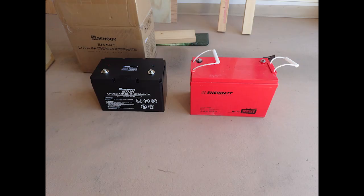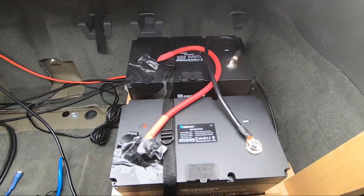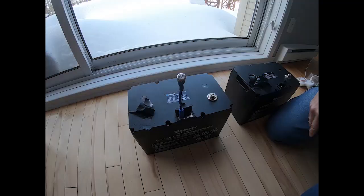Obviously, it is important that no electric conductive material touch both terminals of the battery at the same time. The same logic applies for the end of both wires while connecting them to the battery. Also, one important thing to do is to cover the positive terminal of the battery with something providing electric isolation. As said, at no time should the conductive material touch both terminals of the battery. If something like this occurs, there will be a short circuit. As a precaution to avoid this, I simply put a few layers of electric tape.